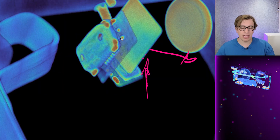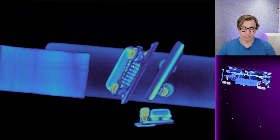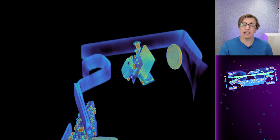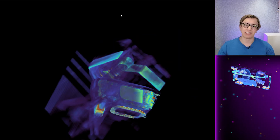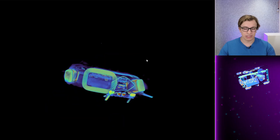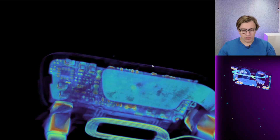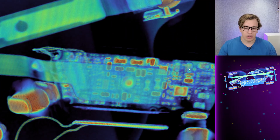This does still leave the question of what's going on in this little backpack. Honestly, I'd believe that it's just connectors or some form of signal processing to drive the display. There's a degree of speculation here, but I think everything's pretty well founded. If you don't agree, you can take a look at the scans yourself and tell me in the comments what I got wrong — I want to learn just as much as you guys. One thing I still want to track down is whether there's a Bluetooth radio just chilling somewhere. I have only looked at one arm piece, and I don't see anything to suggest a Bluetooth radio. It's possible it is using a chip antenna — just a little component that's soldered on and looks basically indistinguishable from anything else, which would make it a little hard to spot.